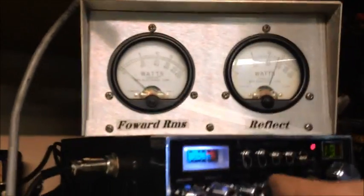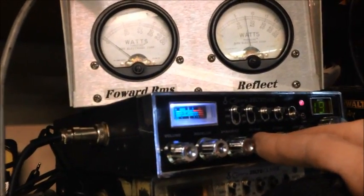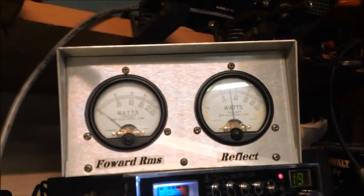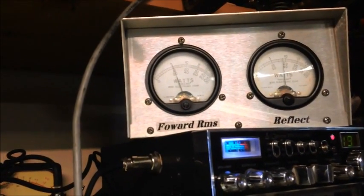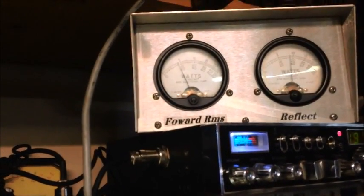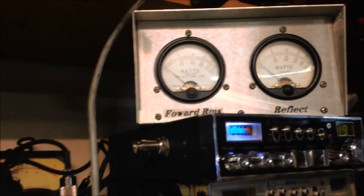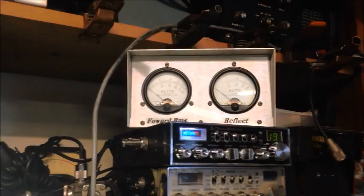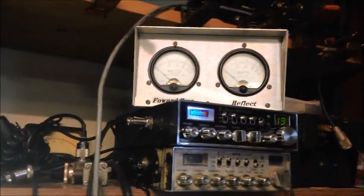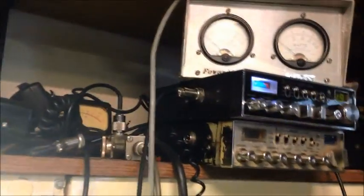We're going to do right there, 3 watts, okay? 3 watts, and then we take the amplifier and we adjust it up to our desired dead key, which is going to be right about in there. That's about 160. Normally this box, if I was running it on my base, I'd be looking for about a 200 watt dead key out of it. But you know, we're going to leave it there. Turning my gain up.